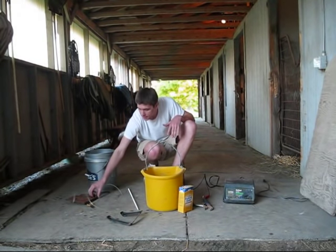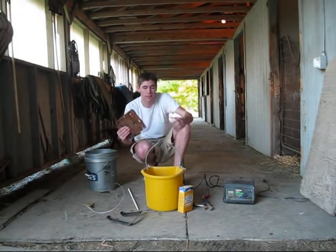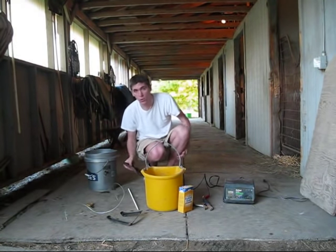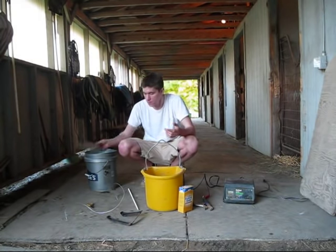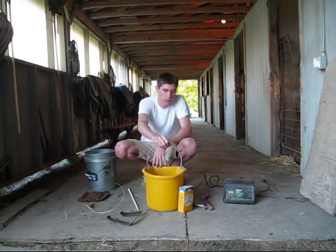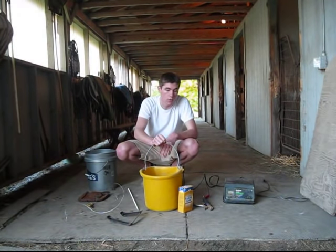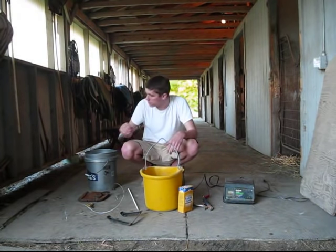For a piece this size, you can see how long it takes. Smaller pieces, they say maybe a couple hours. Big pieces — and it all depends on the amount of rust — you may just want to leave it overnight. So let's go ahead and get started. First thing we want to do is make our solution: 5 gallons of water to 1 cup of baking soda.